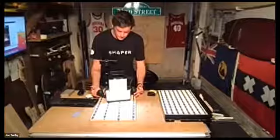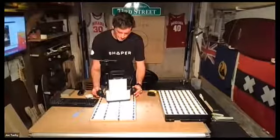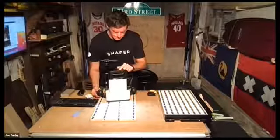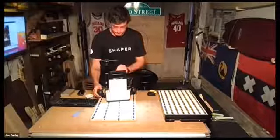There's my pocket. Anytime you cut, it draws a shade of blue showing what you've cut. If you increase the depth it draws a darker shade of blue, so you always have an idea of what you've cut at what depths. Now I'm going to clean up that edge by doing an inside cut at 0.44, then finish with an outer pass at 0.07.